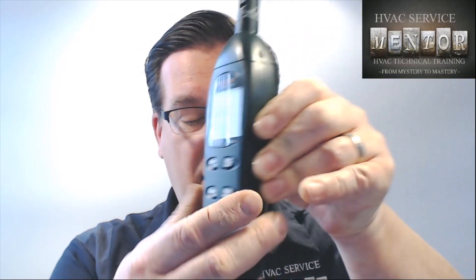At 35% relative humidity I should be seeing a temperature drop of somewhere between 21 and 23 degrees, which would be perfectly normal under those conditions. That's the value of having a psychrometer. Most of the time when I poll groups of technicians, very few people actually have one, but you can see it is crucial for doing air conditioning work effectively. This one I really like — it's made by Extech and has a dual input thermometer for measuring temperature differences too.